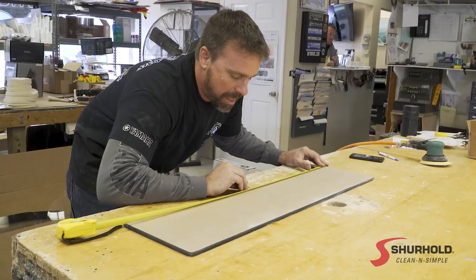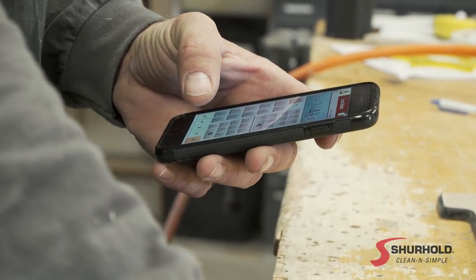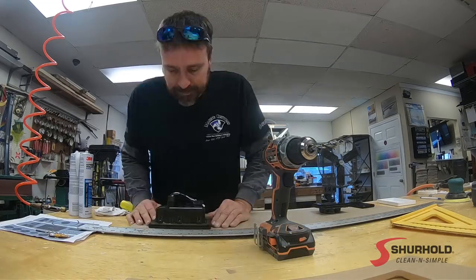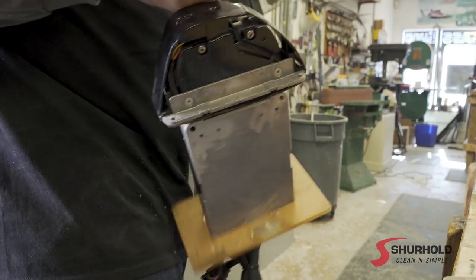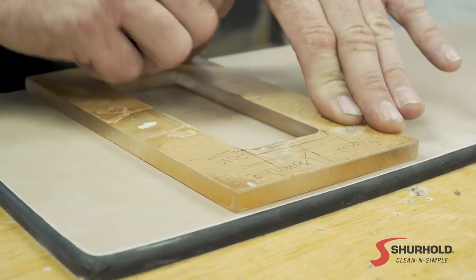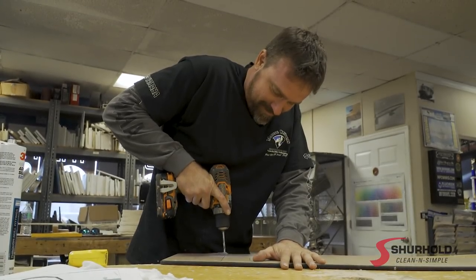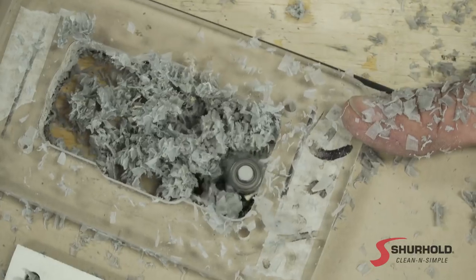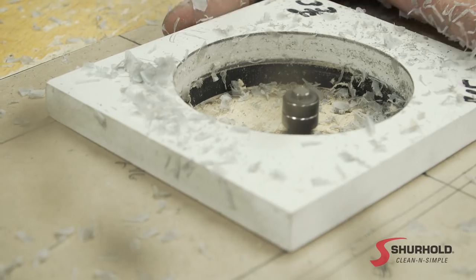Once we had all the panels cut and fit and it looked good, I went ahead and officially made the layout. Doing so you've got to split some fractions and I'm not gifted in math, so the iPhone has been awesome — there's a great app that'll help you out and make everything line up. Sometimes when we get pieces and realize it's the hot thing right now, we'll go ahead and make a jig with that cutout laid out so we can be more efficient later. You're going to want to put a pilot hole in the acrylic — you've got to be careful because if you don't use the right bit you can blow it out, crack the panel. Route it out, give it a nice clean hole that looks like a machine did it.